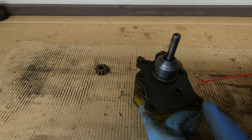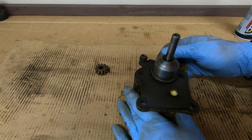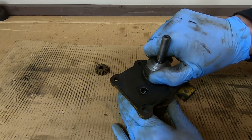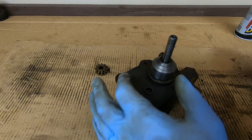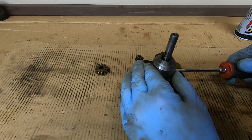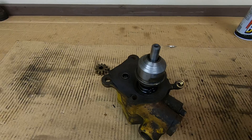Throwing some penetrating oil down that cone-shaped piece and also into the pump gear area — this thing is awfully dry. I took a dead blow hammer and gently tapped the end of the shaft. We do have it moving a little bit; we've initiated some movement on the pump shaft. But I don't want to really start turning on things in case there's anything down there that might scar the body, so I'll just keep working it. There we go — a little bit of movement from prying on it. There's that spring tension I was talking about.